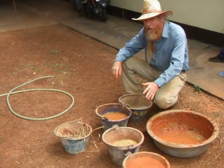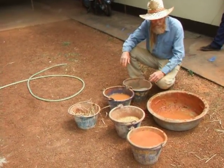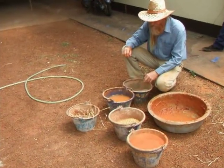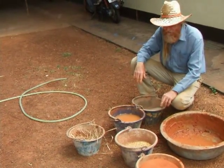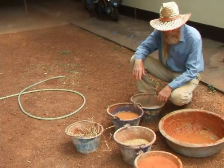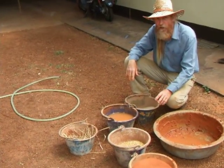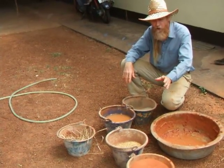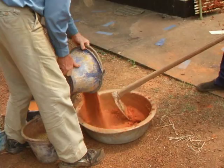This ratio of ingredients worked perfectly, so we're going to use the same recipe for the next batch and add it to the back — that will help it bond together. The only way to know your recipe is to test it out with your local materials, because the soil will vary from location to location. You can pre-soak the clay; that will save some mixing.